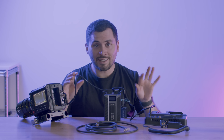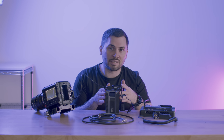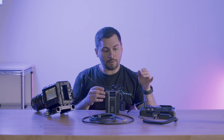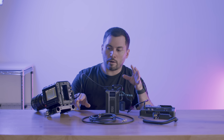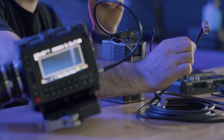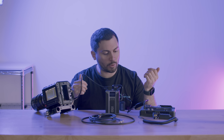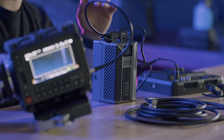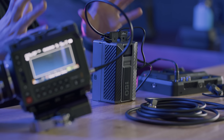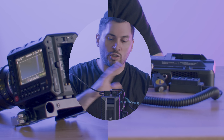But you're not completely safe yet. You're not completely out of the woods. What you now need to think about is what happens when your battery gets low, or what happens when you finish your shoot. If you start unplugging things, this could be another moment where there's power but no ground — and that's an issue, because your video cable is still connected. You definitely want to avoid power being disconnected while the video cable is still connected. So when you're changing batteries or powering down, you want to unplug your video cables first, then you can power down and unplug your power cables.